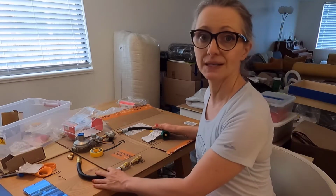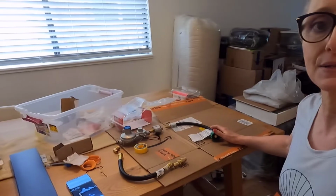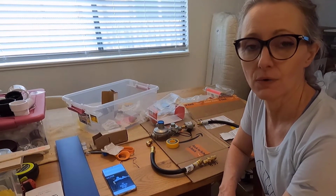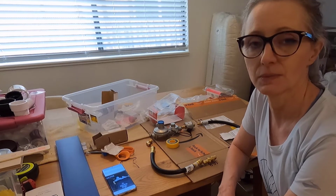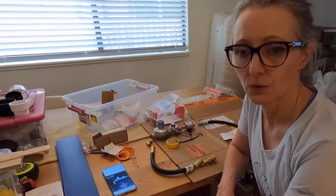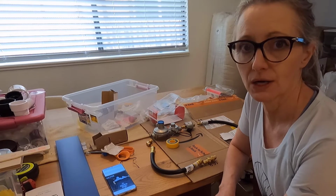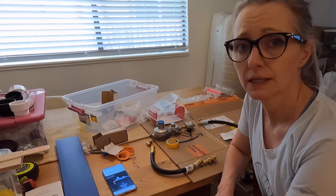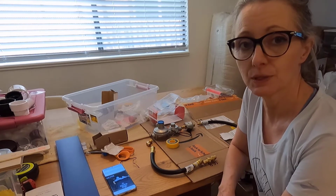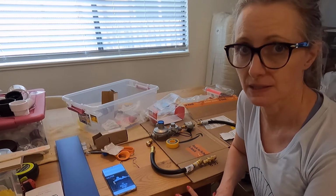So what I started doing here on the table is I started laying out my pieces, right? Now, I am following very much Far Out Ride's recommendations, except I'm not using copper piping to go to my instant hot water tank or my range oven stove. I've realized that I can use very high quality propane tubing to do that better for my installation, okay? But I'm going to point you again to their systems. They're amazing, what they show.